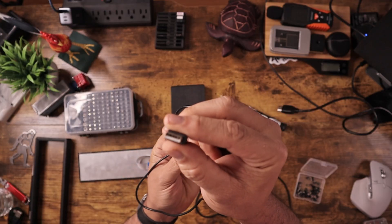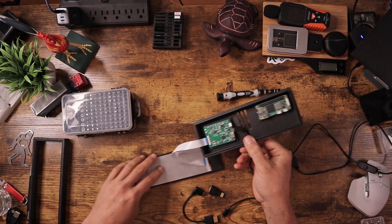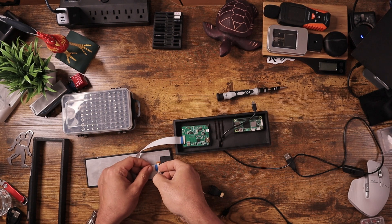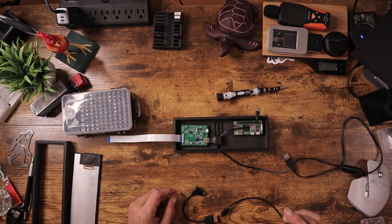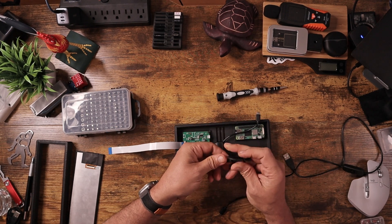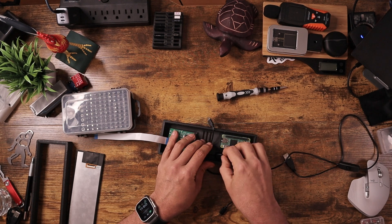I have my Raspberry Pi power cord — one side is normal USB, the other side is micro USB — and I made the hole in the back big enough to slide it through. I could not find a cable that was micro HDMI to micro HDMI, and I don't like soldering, so I went ahead and used all these little cables inside here since it was going to be enclosed. I'll go ahead and twist this cable around just a little bit so that it will fit correctly.